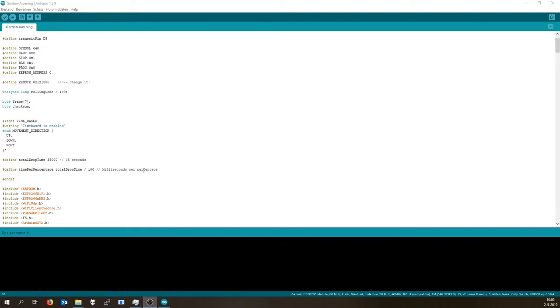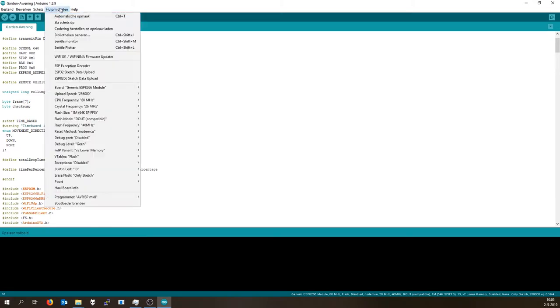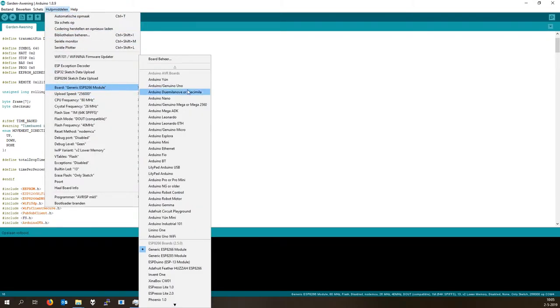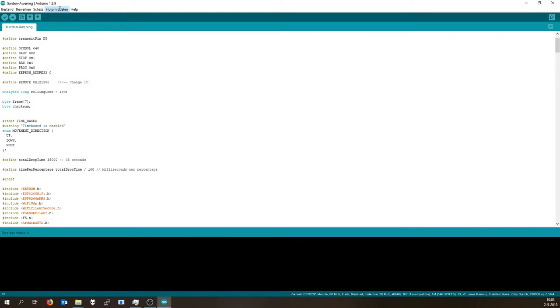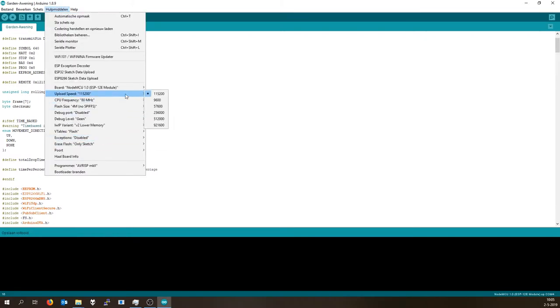So, when you've soldered the PCB and connected the transmitter and level shifter and of course the NodeMCU to the board, it's time to connect it via a USB cable and we're going to program it. Now I've included a link to the code in the description below, so you can download it. You basically need to set a few things under tools and board, pick the NodeMCU 1.0, and wait for the Arduino to load.